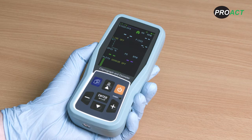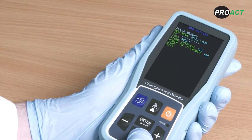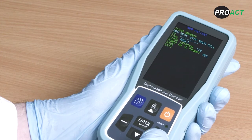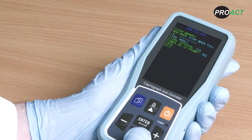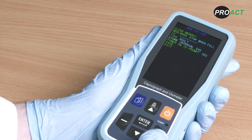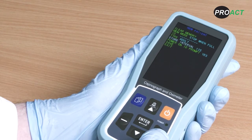Please be sure to read your user manual fully. You can modify the memory mode, choosing to set it to either auto loop or stop when full. Auto loop takes 24 hours of trending memory but as soon as it has reached 24 hours it will delete the oldest data to record new data. Stop when full will inform you when you have reached the maximum memory. You can also change the store sample rate to 12 seconds for 24 hours memory, 6 seconds for 12 hours, or 4 seconds for 8 hours. The longer the sample rate interval, the longer the memory you will have. The PC900B default is set to 12 seconds store sample rate.